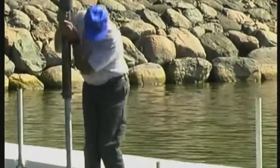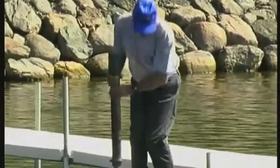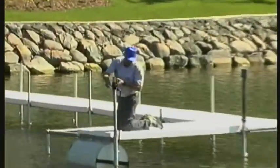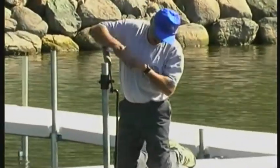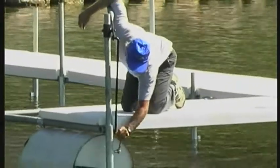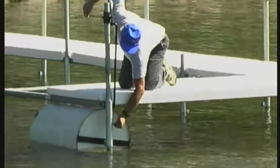When the pipe is driven to the consistent height, the mud plate should be resting firmly on the ground for added deck support. Raise the sun deck end approximately 2 inches higher off the water than the bottom of the barrel bracket clip and tighten the set screw. This will make it easier to move the barrel to the other side.